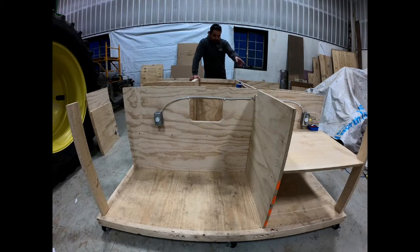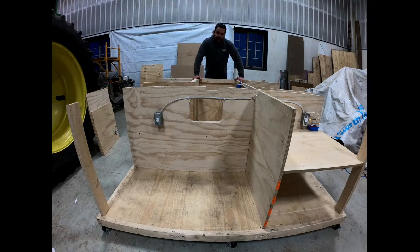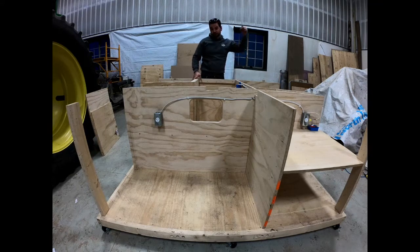In part one and two, we put the frame together. I prepped all the plywood pieces that make up the vertical support of this bench, and in part two we screwed them together, put a few of the floor pieces on, and did the electrical — all before putting the top on so I wouldn't have to crawl around underneath. In part three, my goal is to get most of the top on and then put our first tool on. We're going to start with the table saw.